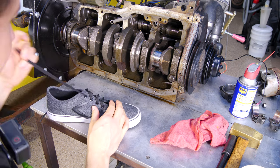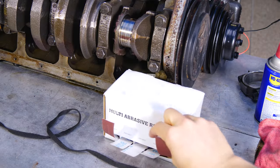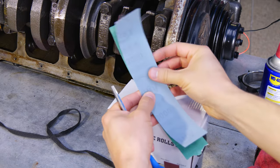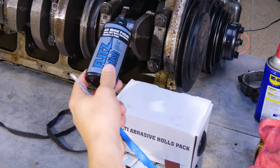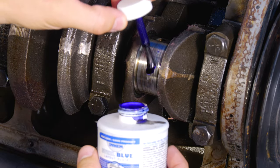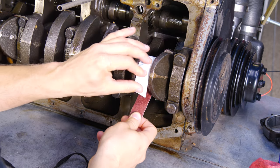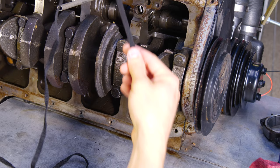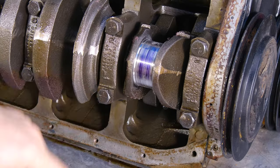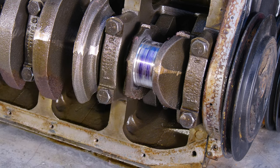I'm going to start with a shoelace because they're flat, and you can feel all these grooves with your fingernail. I'll start with 150 grit — one of the cheapo Amazon emery cloth packs — then go 1500, 3000, and then throw some metal polish at it. I'm going to use some layout fluid that I use sometimes when machining stuff; that'll let us see our progress. Just from doing that first pass, you can see that blue dye is still down in the grooves, so we're going to need a couple more passes with the 150.